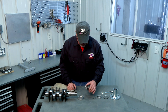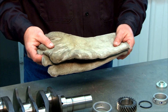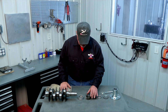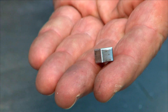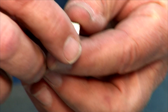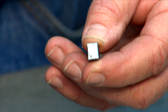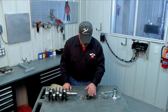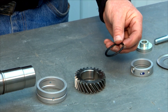Since this gear will be very hot coming out of the oven, you'll need good quality high temperature gloves — welding gloves, oven mitts, whatever you have available. The crank will be cold and the gear will be hot. There is a Woodruff key — a very small square key — and when you get these they're sharp edged, so I like to take them on a fine grinding wheel or Scotch-Brite wheel and take the edges off. Remove all sharp edges and burrs so the key seats fully in the keyway and doesn't hang up on the gear. Once the gear is on, a snap ring goes on to retain it.